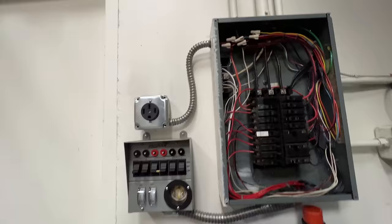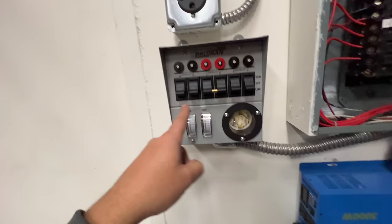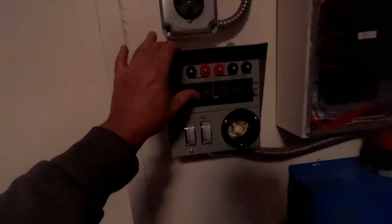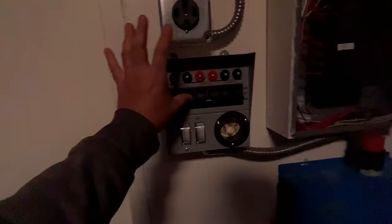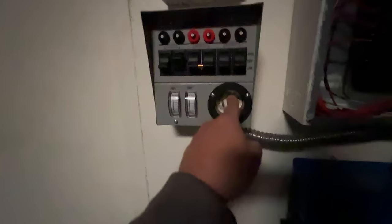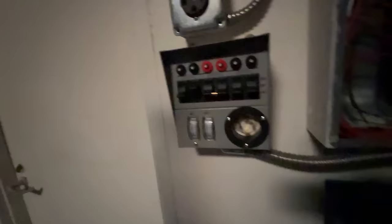So that's what it does. It gets in between, and your circuits, instead of coming in and connecting straight into your breakers, have to go to this first. They go in there and then from there they go here. So that gives you the ability to disconnect. This is the one circuit that connects the lights. Right now the lights are connected to one of these pins but there's no power going in there, so they're off. If I wanted to power the lights, I'd have to electrify two of these pins to get power from here.